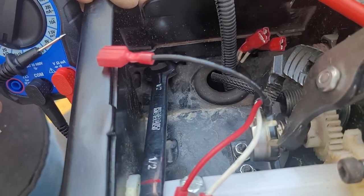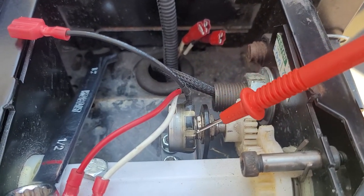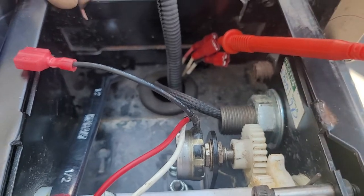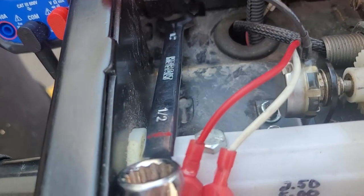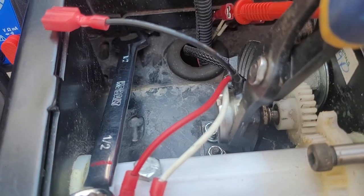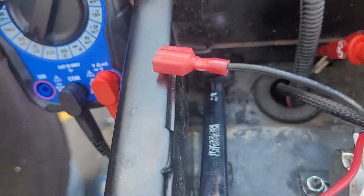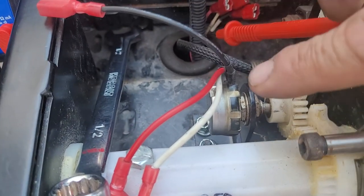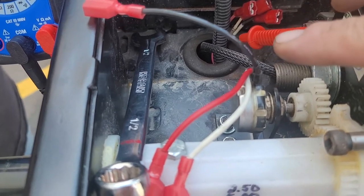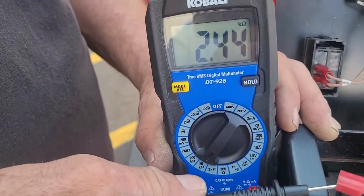Matthew at Gatekeeper told me to take a pair of channel locks and grip the potentiometer — not on the shell, but on the black metal ring all the way around. Wrap it around there, pinch it, and just twist it forward ever so slightly. Too much and you'll overshoot — the potentiometer had rotated too far and I had to bring it back to get the 2.48 reading.